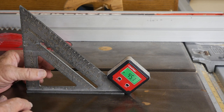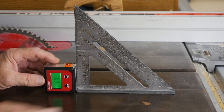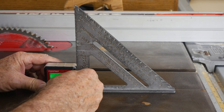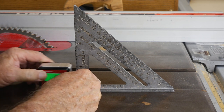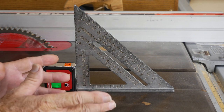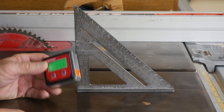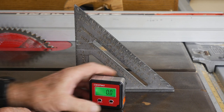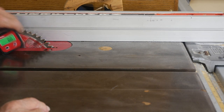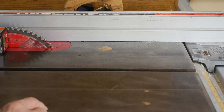So 45.1 — that's pretty close but that's not exactly 45 degrees. Is my speed square wrong all these years? The next thing I'm gonna do is put it up against this side and it says 89.9. It's trying to drift a little bit scale-wise. Eighty-nine point nine — so all these years of building and construction, apparently my speed square is no good. It's very sensitive and the numbers jump all over the place. I'm not really liking it.